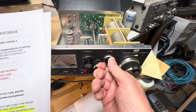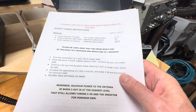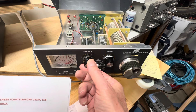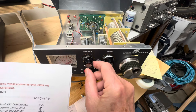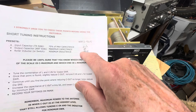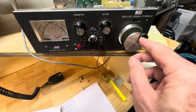A warning that maximum capacitance is not always full scale, so don't guess. In our case, maximum is fully meshed and that is zero on both capacitors. DJ0IP's short tuning instructions say: set transmitter to 75% — so if zero is 10 and 100 is zero on a scale of 10, two and a half is 75%. Here are my MFJ969 settings: maximum capacitance on the output capacitor is zero, and minimum inductance is zero. So we will go down to zero.